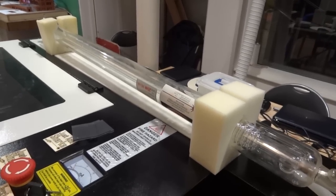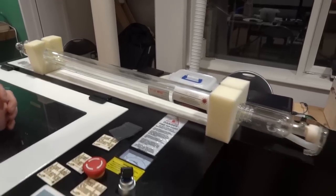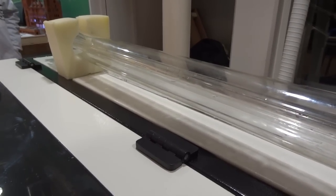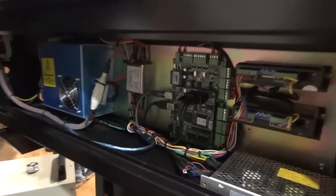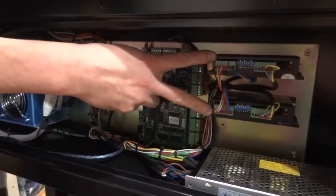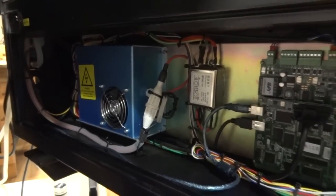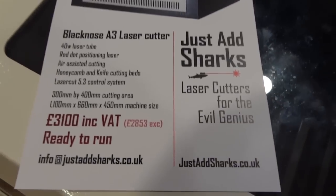Here's the laser tube — it's a 40-watt glass CO2 laser that would normally be inside the machine. It has three layers of glass: the inner layer is filled with CO2, the middle layer is filled with water, providing a water-cooled jacket to keep it cool during operation. You pump water around the skin and high voltage in one end, and the laser beam comes out the other. Inside the machine there's the laser cut controller connecting to two standard stepper motor drivers, a big power supply for stepper motor power, and the laser power supply on the other side — a very simple, modular design that's really easily hackable and ripe for open-source software. Check out justaddsharks.co.uk for more information.